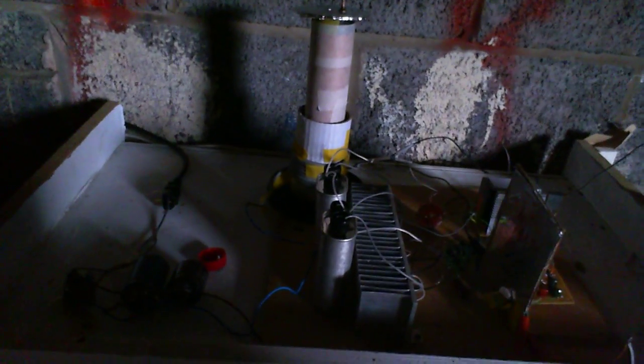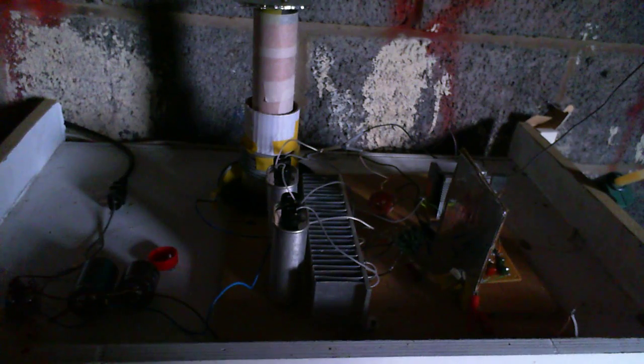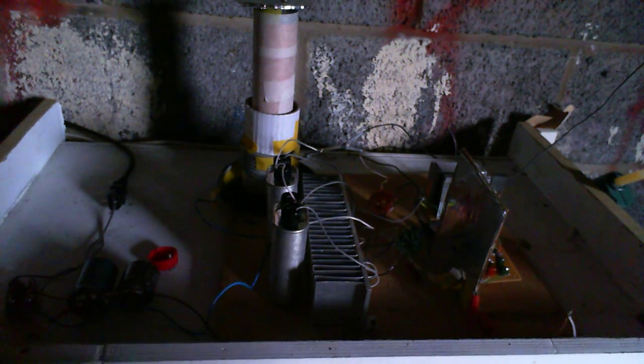As you can see, there's wire coming out going into the capacitors. This is where this thing could blow up or catch fire, because my gate drive transformer could flash over — that's going to be at about 340 volts potential. The RF could fry my control board, or my MOSFETs could explode or catch fire. And of course there is the infamous Miller effect, where when you put more load onto a MOSFET, the effective gate capacitance increases. I'm just going to retreat to somewhere where I'm safe and we'll turn this on.